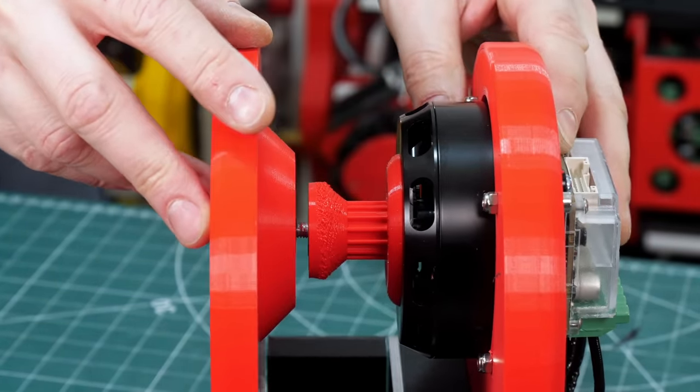So these are roughly 100 to 1, and the motor does around 60 to 70 turns or revolutions per second. So we should have loads of torque, and I've also got the ability to stop and start those wheels and reverse them. And we're using regen basically to recharge the battery to get rid of all that energy. So that seems to operate pretty reliably, and I think that's going to be fine.